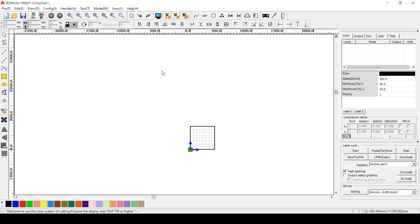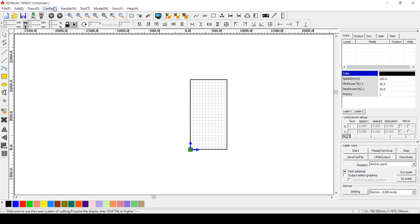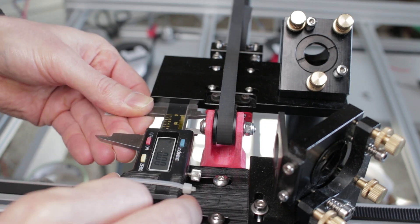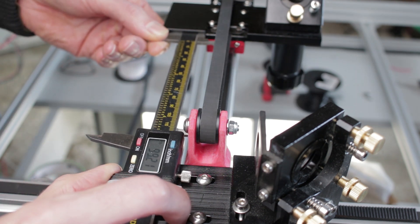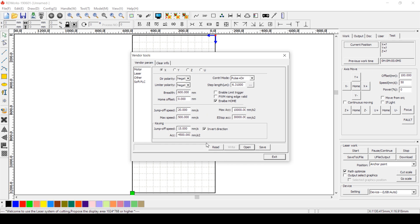Let's crack out the laptop and get into the software. This is RDWorks V8 — I don't think that's referring to its engine layout. The first thing I need to do is check the software and the hardware are talking to each other. I'm plugged in by USB, so if I go over here to read, it should tell me the position of the laser. It's updated the bed but I need to adjust the home position. I'm going to calibrate the axes so they're all doing what the computer thinks they're doing: I'll bring the X-axis over to the end, zero out my calipers, then tell the software to move 100mm and measure how far it actually moved. I take those two numbers and put them back into the software to get my correct ratio, then repeat this on the Y-axis.